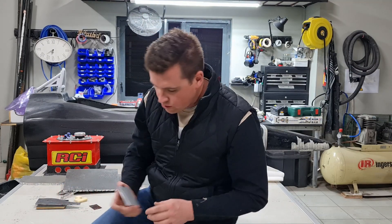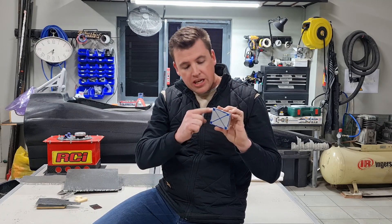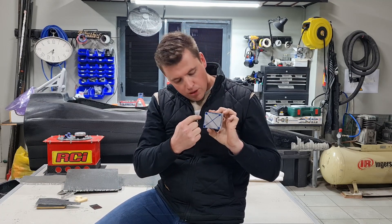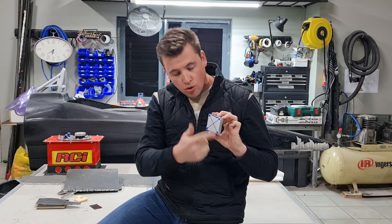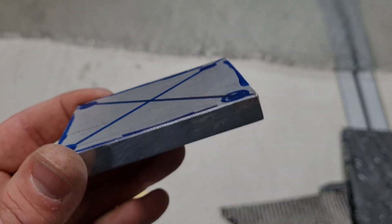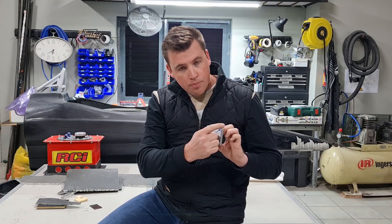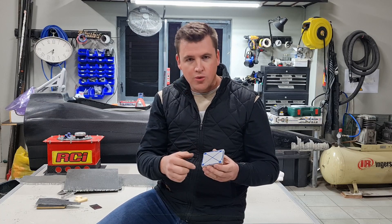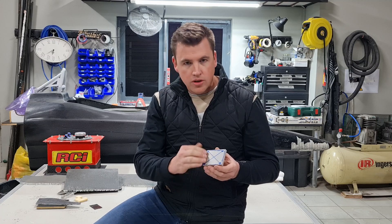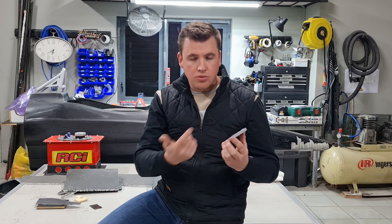To quickly run through the aluminium inserts: we took the inserts, got them machined on the edges all around, then cut grooves right across and drilled six holes in each corner. We wanted the resin to be able to flow so there were no dry spots wherever the inserts were. We didn't want sharp edges that could rip through the composite layer on impact. We machined all the edges, machined the grooves, and even etched the finish so it had a textured feeling to it. I'll get another one made up to actually show you what it ended up looking like.